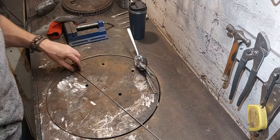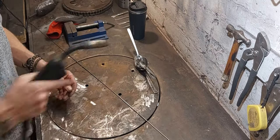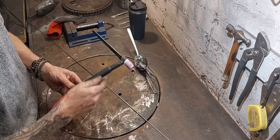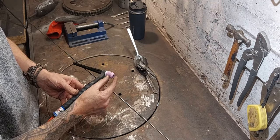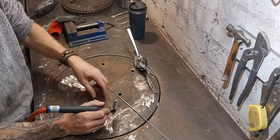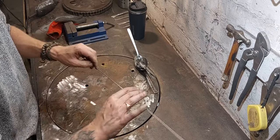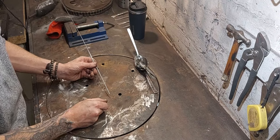Okay, so I'm going to make the legs out of this, and this is welding filler rod for a TIG welder. So if you remember what I was saying earlier about the MIG welder, when I pull the handle it shoots wire out, and that's what adds material to make the weld. The TIG welder works slightly differently. This is the TIG gun. It's very precise, you can hold it like a pencil, and it has no wire coming out, but it has a very sharp point of tungsten, a bit like the end of a dart. And what you do is you hold that, press the foot pedal, it puts a massive amount of heat, like a plasma arc if you like, to the metal, and then you have to manually add the material. So instead of the wire coming out, you are by hand heating it up and just feeding this into the weld puddle like that.